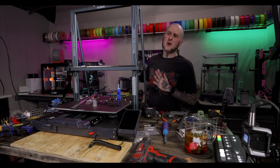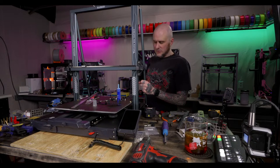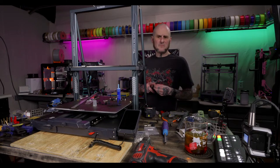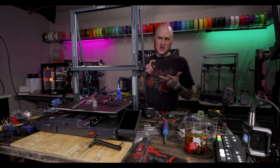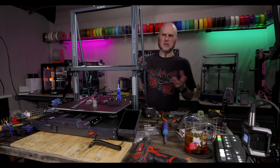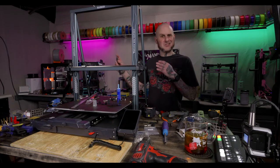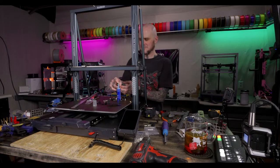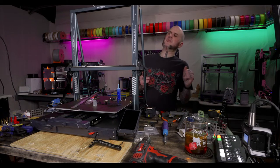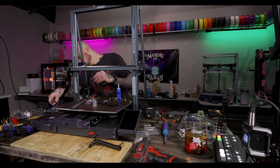Been setting up the Revo CR on my Ender 3. Any tips for setting up profiles on different nozzle sizes? Got the fully loaded kit. Just tune each one as if it's a completely different thing. Honestly, because temperature, retractions, pressure advance values, linear advance values, whichever you're using, Marlin or Klipper, they'll behave differently with different nozzle sizes. Tune each filament to each nozzle size. It's annoying, but it's the way you get the best results. Especially linear advance. Linear advance values can dramatically vary between nozzle sizes. Flow and temperature, less so. Dang it.